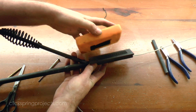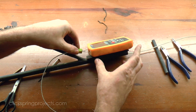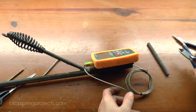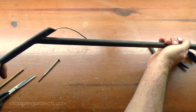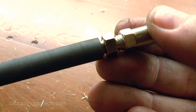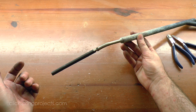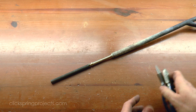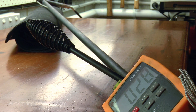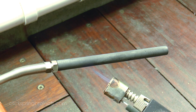Now the thermometer needs to come off fairly often for battery changes and so on, so I've gone for a simple velcro patch to hold it in place, and I generally just tie off the excess cable underneath. The new carbon sleeve threads neatly onto the probe, and the spring provides a small measure of protection from shocks and inadvertent knocks when it's in use. Without any heat applied, the unit should be showing the ambient air temperature, and then a quick test with a torch should show the temperature rising, as expected.